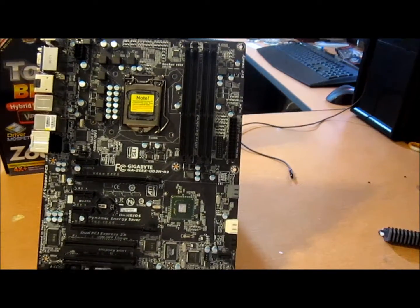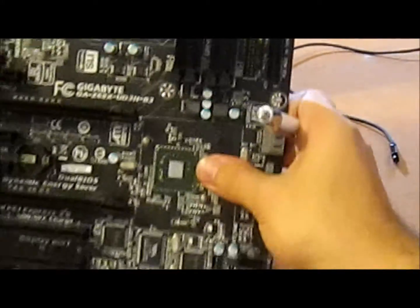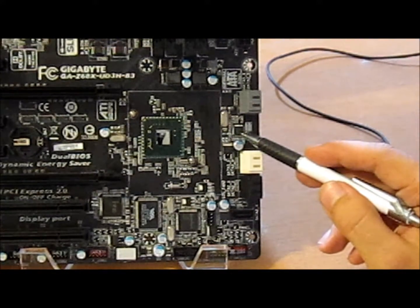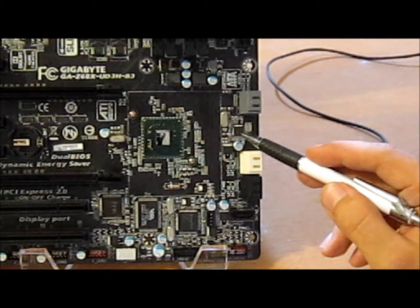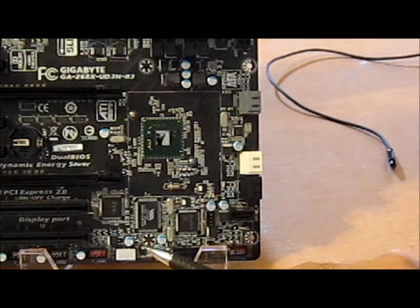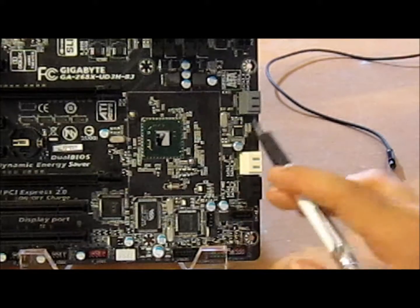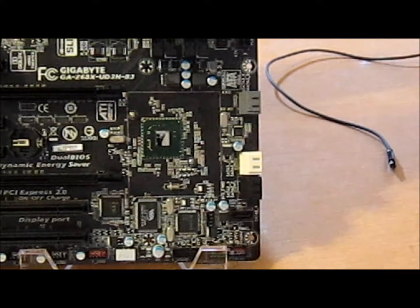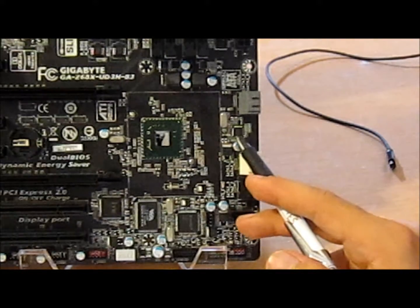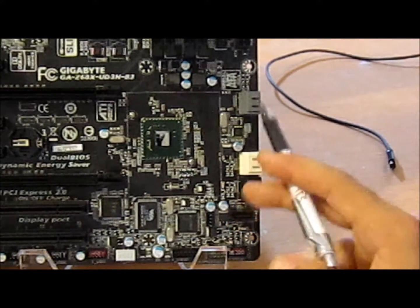Alright, maybe let's get a little zoom up on the lower half. Here we have Marvell SE9172, Marvell's 2nd generation SATA 6 Gb/s ports. They're in gray. I would not RAID them, even though they can RAID. I would RAID SATA 3 Gb/s devices on this, but I would not RAID SATA 6 Gb/s devices on this unless they're HDDs. Okay. I just don't think it can handle it. The SE9128 can definitely handle it, just as well, if not better than Intel, but the 9172, not so much.